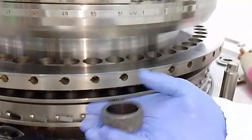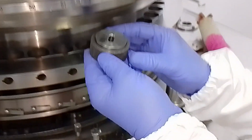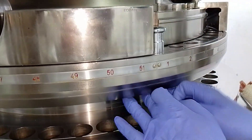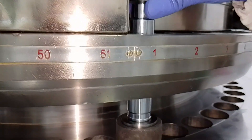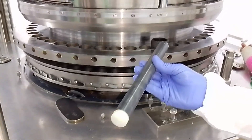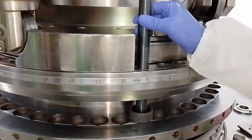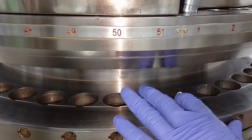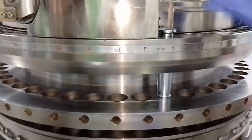After this, take the die insertion ring. Remember to place the die properly inside the insertion ring. After setting the die, put a punch and check its alignment — whether the alignment of the die is proper or not. Check if there is any clicking sound or any sound of the punch hitting it. You can also check by turning the punch a little clockwise. After this, take the die driving rod and press the die at the place where you had set it. Remember that the die should be set properly. Insert the punch once more and see if there is any abnormal or clicking sound. If there is sound, it means the alignment of your die is not correct. If set properly, there should be no sound.